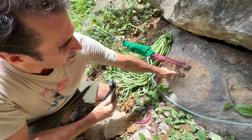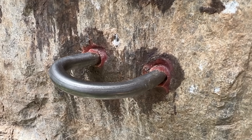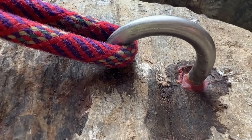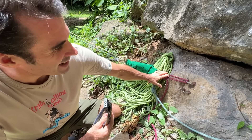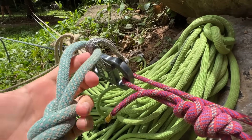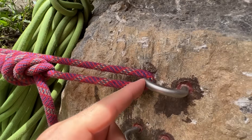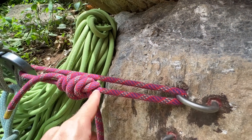Here we've got an 8mm U-bolt, and here is a 9mm staple, and we've got RE500 glue. Why is it all bent? We did a pull test on it already. What we want to do is have the rope break, not the bolt break. So we've got the line scale 3. This is the backup, so when it goes flying, this will catch it. But this rope is going through here, and we'll find out if it breaks here or if it breaks in the knot.